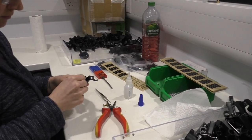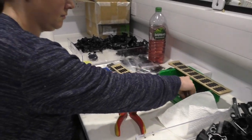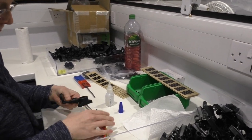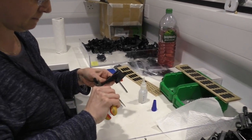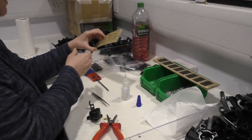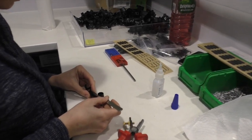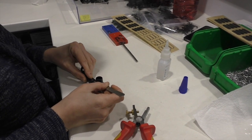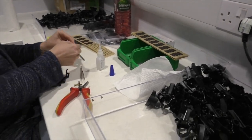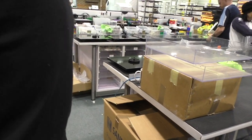There's even a movement in Japan that believes there are no anti-skating effects. That doesn't make any sense. It makes a difference of about 1/8 to 1/10 of a gram. If you're into that. I'm not into the stylus riding the inner groove the whole way in, which is what's going to happen if there's no counterforce. That's my feeling. That's our way on these arms only. And I think that makes sense. I think we'd like to do it far more, but market acceptance. Yeah, I'm not sure you'd get market acceptance in that. But having the magnetic thing works well too. Okay, so let's see what's going on next here.